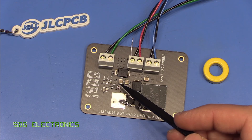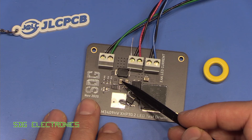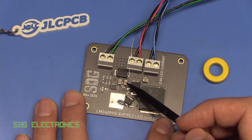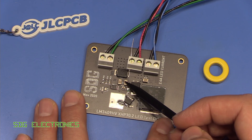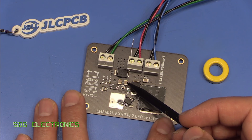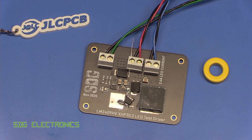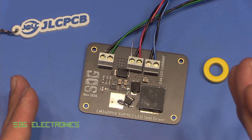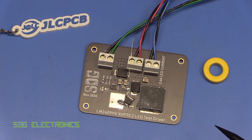The other point is about the ceramic capacitors on the board. Some of these ceramic capacitors, particularly where they are seeing quite high changes in current, can make a sound even though you wouldn't normally expect that. Ceramic capacitors are very microphonic, particularly where the construction is large — these are 1210 or something like that, so they have quite large plates. I have known designs in the past to make sound entirely from ceramic capacitors. What's happening is that we're chopping up the switching waveform — up at 125 kilohertz, modified to 300 kilohertz on this one — and because we're chopping it with our PWM waveform and seeing quite high peak currents every time we turn on the circuit through the enable pin, we're possibly hearing sound from these ceramic capacitors.